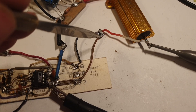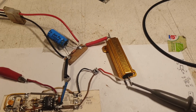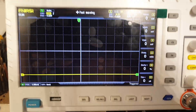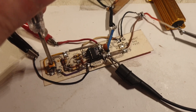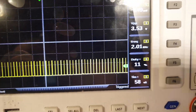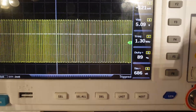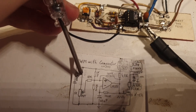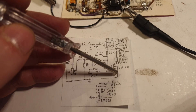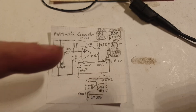Now I put my oscilloscope on this resistor, between the drain and source. Let's see the waveform. I'm getting 89-90% duty cycle at this end. When I change it, I'm getting 11% duty cycle — very stable. So those are the two margins: 11% and 89%. I proved that by taking those two diodes out I can get to the 10% limit on both sides of the circuit — now I can read it from here as well.